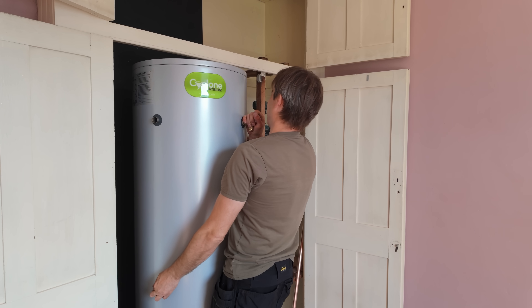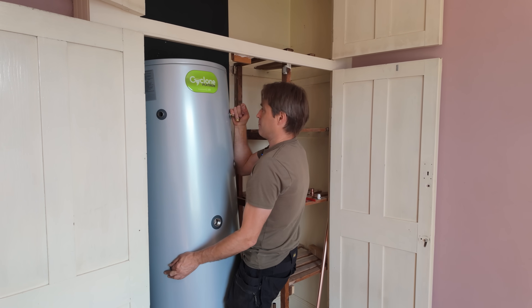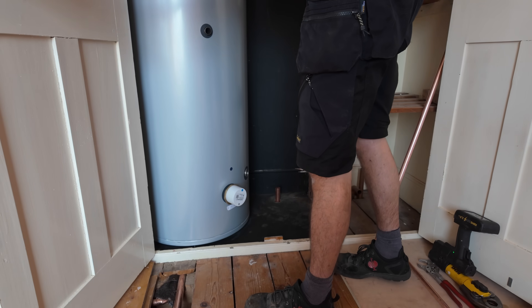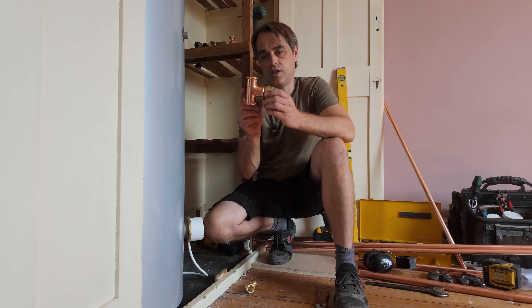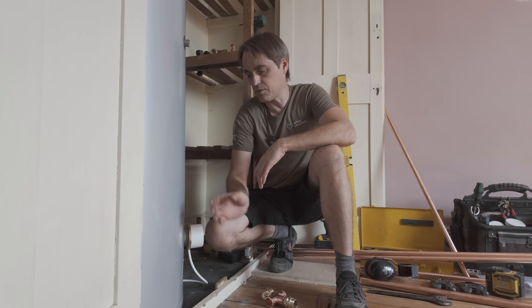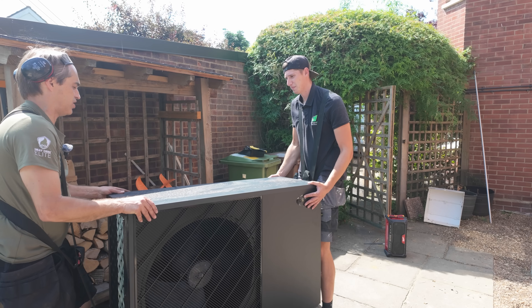...540 millimeters as well — exactly. I wish I hadn't ply-lined the wall. Height-wise it just about fits. The door doesn't close because the immersion touches it. So we just about managed to get the cylinder in, but we had to remove a tee. Normally I'd put the cold water supply from the top, drain cock on the bottom, and one-inch connection to the cylinder. Instead we used a one-inch male iron to elbow — saving about 50mm — which allows us to fit the cylinder in with two to three millimeters to spare.